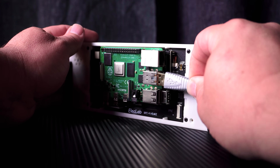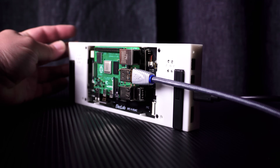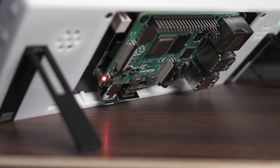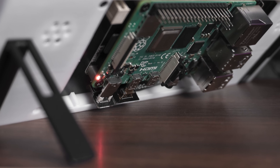I used a USB A to B cable from Monolith and a GeekPie power supply, both purchased separately. The power supply has to be 5 volts and 4 amps for everything to work correctly — I used a different one and it all went to hell. Links will be in the description below. I love the little legs it has in the back; it allows it to sit at a perfect angle to view and interact with the screen. Once you've got things up and running, you'll need to download the touchscreen plugin on Volumio.